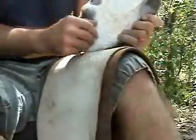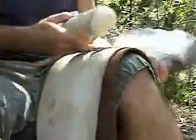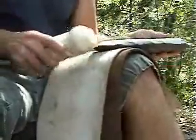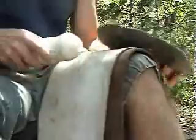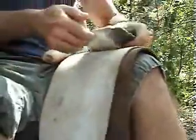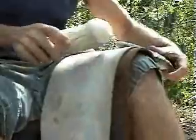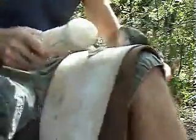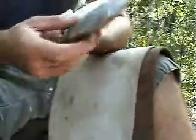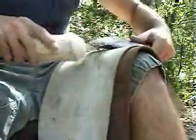There's one of those hinges I told you about. Now we'll come back around and make sure we clean that up from this side. You've got to pick and choose your big flakes. That one took care of it. You can see where it was on my leather. You want to make sure you don't press too hard, because that's how you can get the reverse hinges if your angle's wrong.